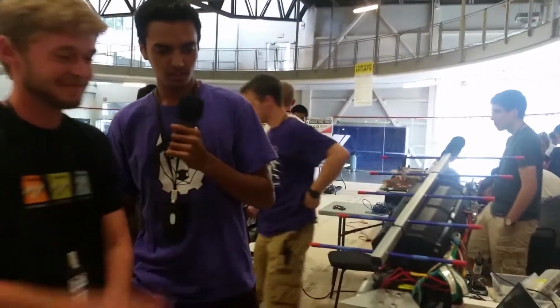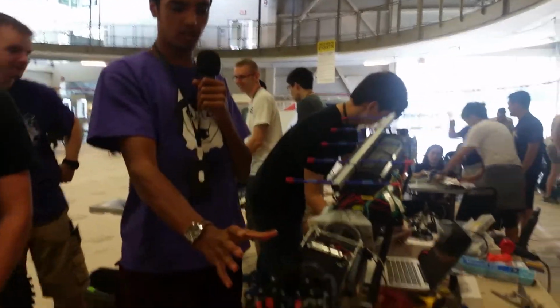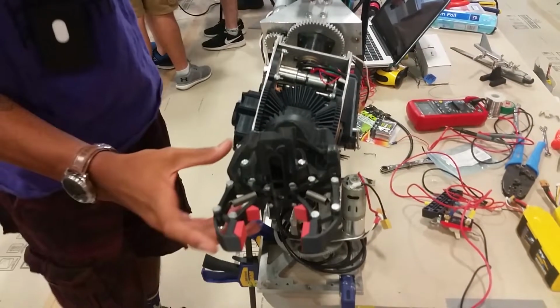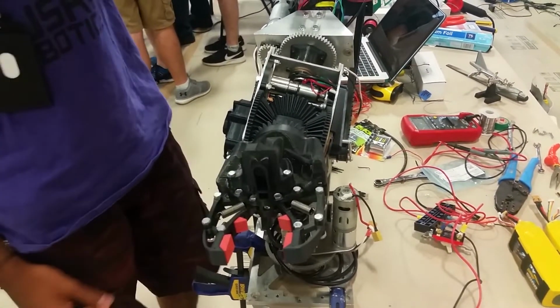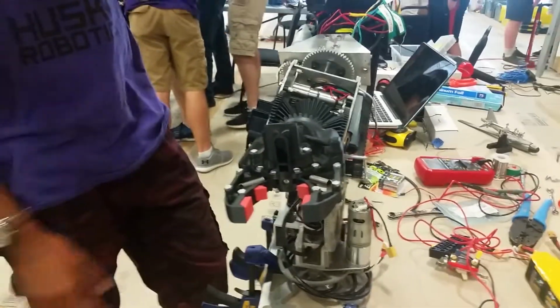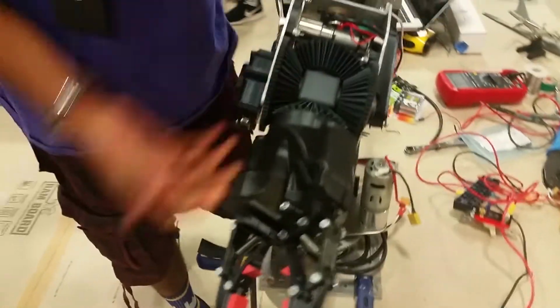Sure. So I worked a lot on the mechanical design of the arm this year, and a lot of the design in the wrist and hand I did myself. Pretty much all these components are 3D printed, spare for some bolts and some shafts that are metal. These actually have an adaptive grip, so when we grab something that's more rounded, we can contort around it, such as a tool handle. And then these are actually erasers, which have very good grip. And then we have a laser beam in the center for targeting, and also the camera on board, as well as some sensors.